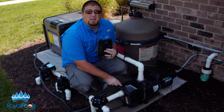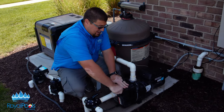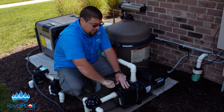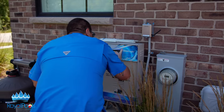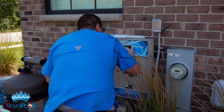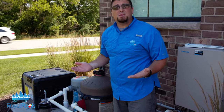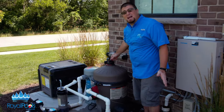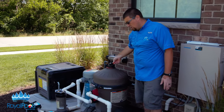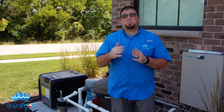You kind of want to move quickly here. You don't really want to walk over the garden hose, turn the spigot off, stuff like that — just set it aside. Put your lid back on. If you had your bleeder valve open, make sure it's closed. Start it back up, and that water you just put in there is going to get sucked in and we're going to hope it holds a prime. What we're looking for is the water to come back up — which it just did. Same concept: we're going to bleed the air out until we start seeing water. That's exactly how you want to prime your pool pump. That is initial startup or re-priming. They are self-priming pumps, but sometimes you've got to give it a little help.